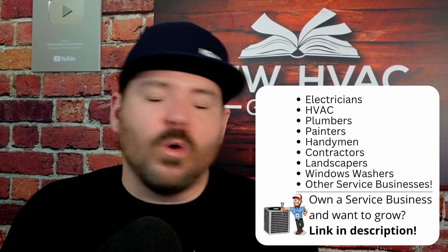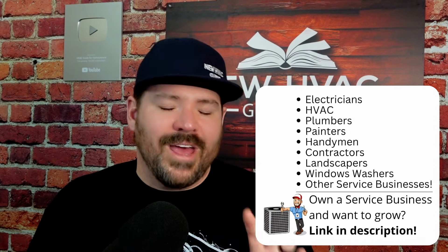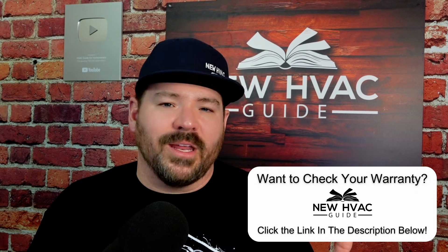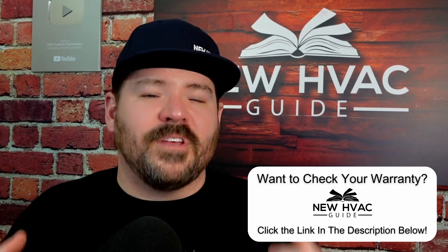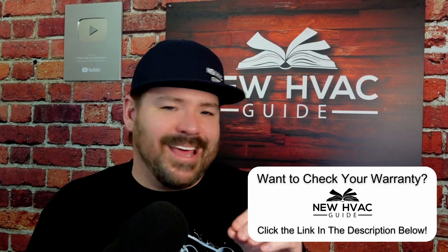Please read the instructions, and please don't do anything that's not code. Don't go into the furnace and disable the sensor when you are pairing it with an A2L system. Don't install an R32 outdoor unit and indoor evaporator coil and simply not plug the sensor in because you don't have anything to plug it into, without installing that Dragonfly board — I can see the safety ramifications from someone doing that. The cool thing about the Dragonfly board is it will also work with modular blowers. If you have one of those modular blowers with the coil mounted on top, you'll still be able to use it in those situations as well.